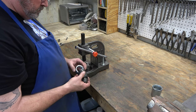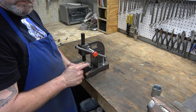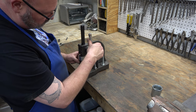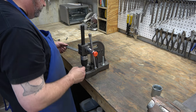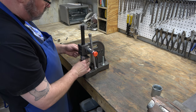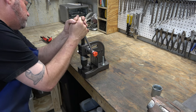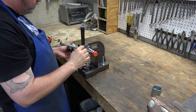Now we're going to disassemble the Jacob's Chuck. I've actually got one of these collars, but all you need is a piece of pipe or a coupler that's the proper inside diameter to fit the chuck. When you do this, you want to make sure that the jaws protrude from the base of the chuck by about a half an inch — maybe a little bit shy of a half an inch. If they're all the way retracted inside the chuck when you do this, you will break off the teeth on the back end of those jaws. I've got the jaws positioned so we're applying pressure to the body of the chuck, not the jaws.